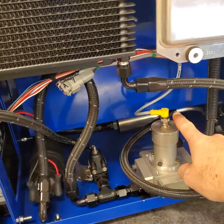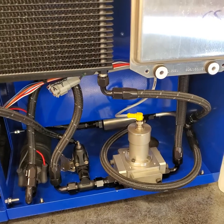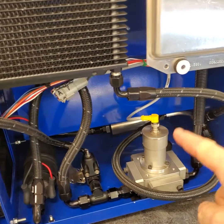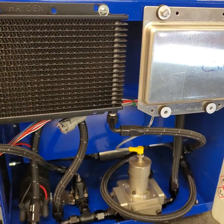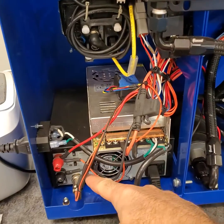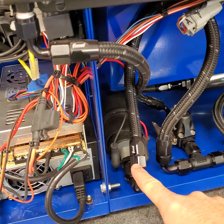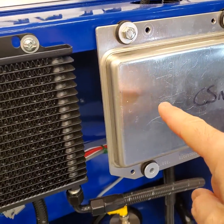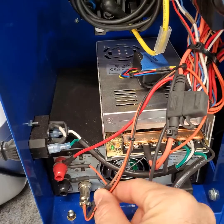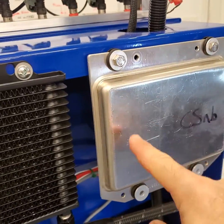The other key feature is our flow meter. These are expensive — I tested a lot of different flow meters and was hoping I could get away with a more affordable unit. It turns out if we want good quality data, we need good quality hardware, and then we need controls built into our ECU here to run everything properly. That ECU also controls one of our power supplies. We have two power supplies: a fixed supply that gives 13.5 volts to our fuel pump all the time, so even if we're running the injectors and ECU down at 9 volts with the variable power supply, the fuel pump keeps rail pressure very consistent.